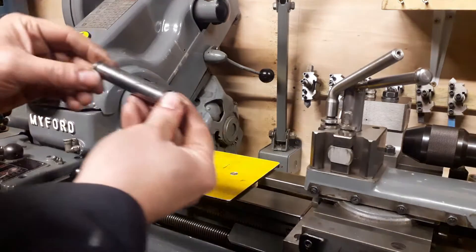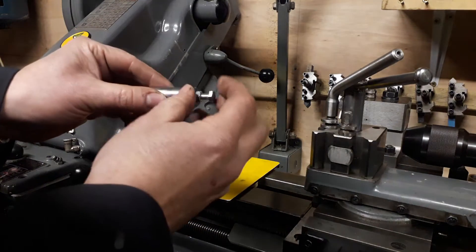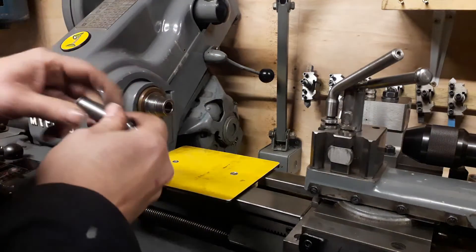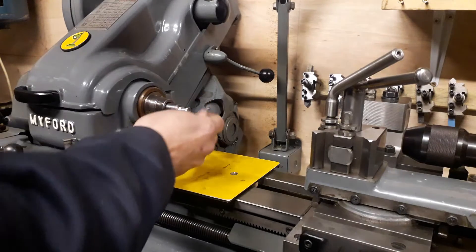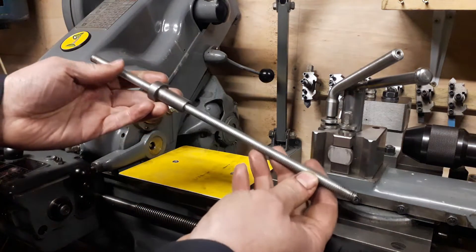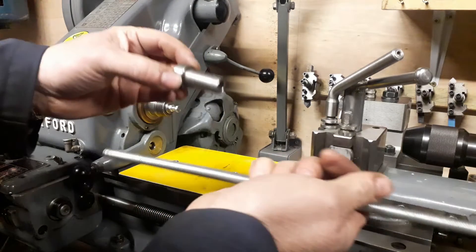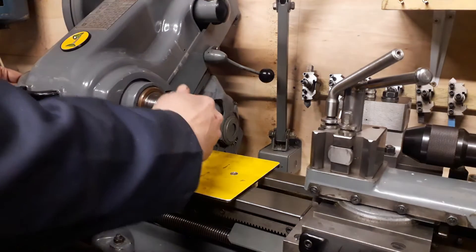So this is an old morse taper with a 10mm drawbar on it — I think it was one of those blanks you can get, or something a previous machine had done. We put it in the headstock, used the drawbar, and drilled and tapped it for an M6 bolt and a nut. The drawbar is just a simple piece of 10mm threaded rod, and I made a little adapter bush that goes into the end of the spindle — that stops your M10 rattling around all over the place. So that just screws in.